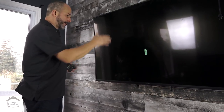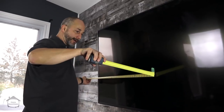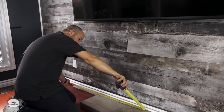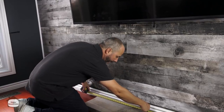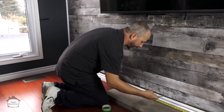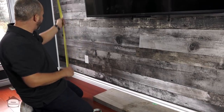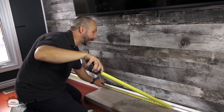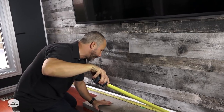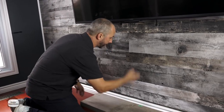The secret here: this room has been done very symmetrically, so we do have a center line — that's what the tape represents, that's my center point. What I've done is measured off from the wall. I get my mark. I want to translate that mark down here to 67 and a half inches. In order to do that I need to know the middle of this board, so we're going to measure this one off at 22 inches. I'm going to put my mark on my tape, then slide this to 67 and a half — that's what my mark says from the wall. That is where my shelf is going to go as far as that location.